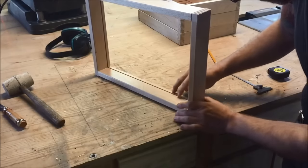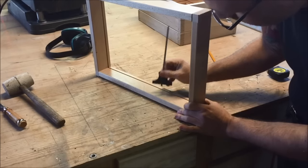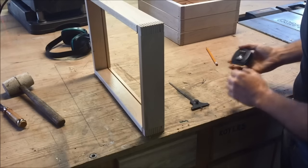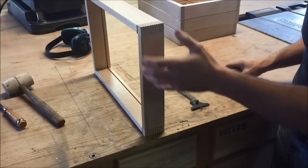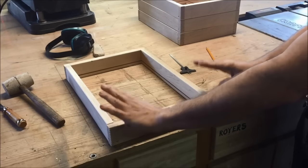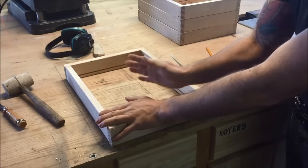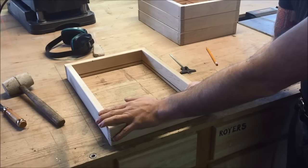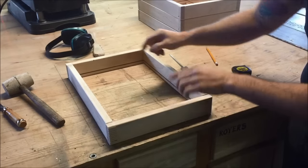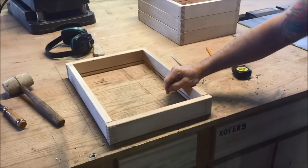The next thing we have to do is start cutting for the bottoms. My material already has a dado in it, and I measured it with my depth tool — it equals out to a quarter inch. So the measurement on the inside is 10 and 3/8, plus a quarter, plus a quarter, which comes to right around 10 and 7/8. I'm going to stay a little under that for wiggle room. Just make sure you add whatever depth your dado is when sizing your bottoms.